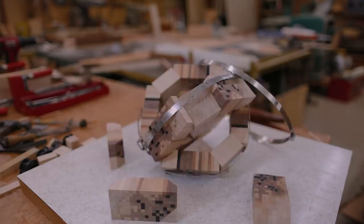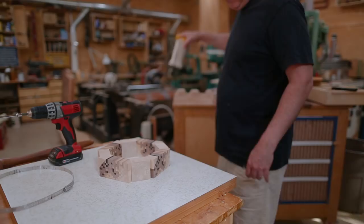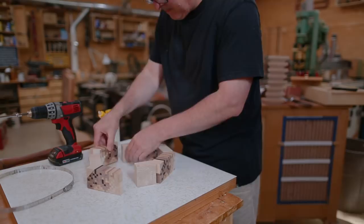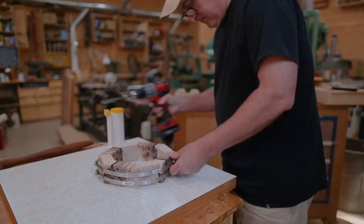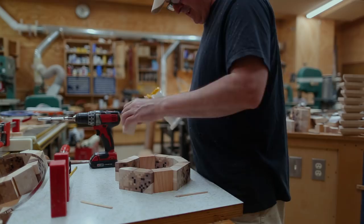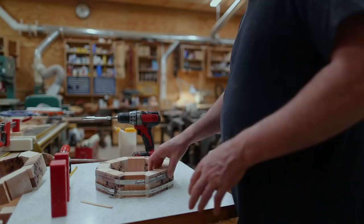One could just take all these pieces, put glue on all the joints, glue it together in one big blob, throw a whole bunch of clamps around it and hope for the best — and I almost did that. But really in any kind of woodworking where you're adding and subtracting, you need to do it in steps so that you can cut off any bit of slop that's showing up in the pieces and the glue-ups. So the first thing I did was glue one of the rings all the way around, then glue the secondary ring with some dummy blocks as spacers. At this point I'm just worrying about the glue joints and getting it fairly flat, and you can start to see how it's going to go together.